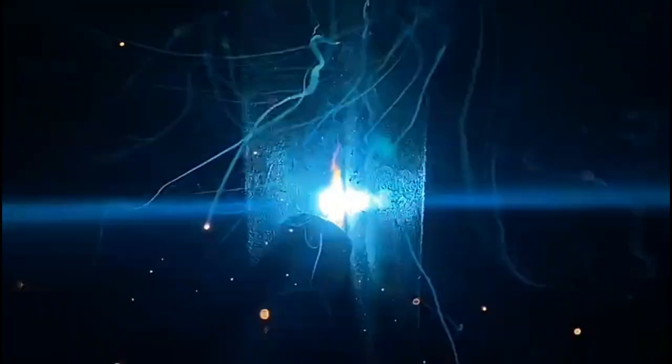The optimal idea of the first run is to put fusion into the two plates, so we need to concentrate our heat into the corner of that joint to get penetration into both plates. We're only putting a very slight weave on our torch.